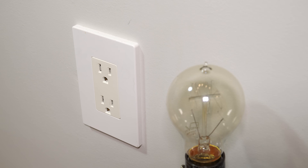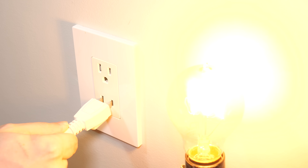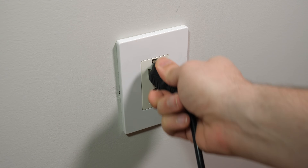Why do some folks insist we should turn this frown upside down? There are two main reasons, both of which ultimately stem from the fact that the design of this plug and its receptacle is bad. The blades aren't sleeved with any insulating material, and when the plug is partially inserted it becomes live despite the conductive blades remaining ever so touchable — especially with small fingers like a child's. If the outlet were simply rotated 180 degrees, the risk of accidentally touching the live blade as you insert or remove the plug becomes much more mitigated. Now the ground pin is on top, so it's a lot harder to get your thumb in there.